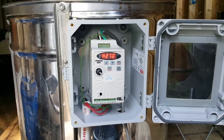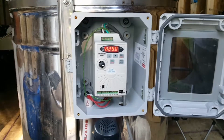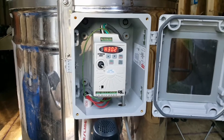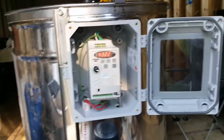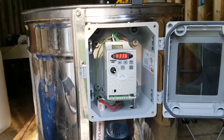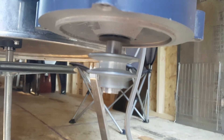I've got it set up so that it will ramp from zero RPM to full RPM in five minutes. You can see on the display the hertz — we're just about at half speed, which is 30 hertz. I figure that's great because instead of fiddling with the speed control, I can just let this thing slowly ramp by itself if there's any imbalance in the basket. I think it will sort itself out by the time we get up to the higher RPMs. I haven't bought a belt yet though, so that's the last thing I've got to get.